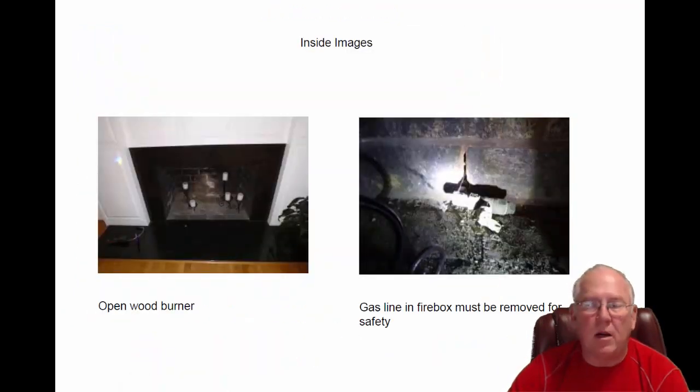We've got an open wood-burning fireplace. These people had gas logs in here at one time — this is not a log lighter, it's gas logs. And this is what is left of what is called a ball valve or service valve. The handle has melted, and no doubt it's melted inside. I don't know if that gas is under pressure or not — it needs to be determined before a wood fire could be set in here. That plumbing cannot be used for future gas logs; it needs to be completely removed. A hole needs to be sealed up there, and if you decide to do gas logs in the future, a permit needs to be pulled and a licensed plumber needs to run it properly.